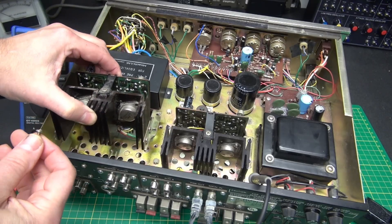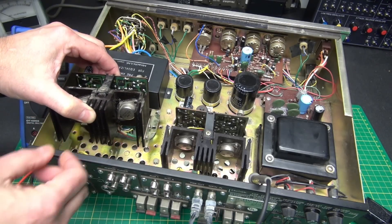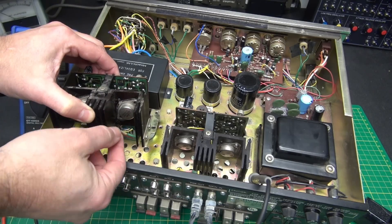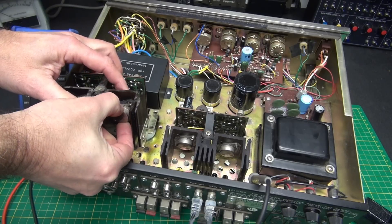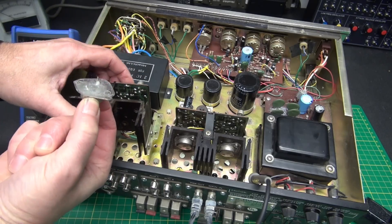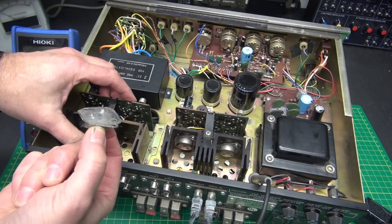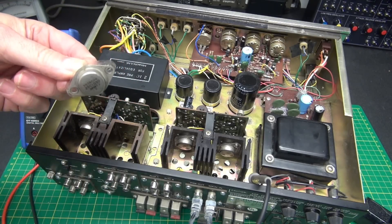This Hitachi has a nice design because you can actually lift the modules out, get the screws out, and these TO3 transistors simply plug in. Just cradle them in your hand, be careful of the piece of mica which is an insulator, and the transistor will pop right out. Let's put it on the bench and buzz out just this transistor.